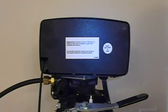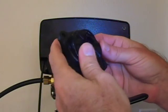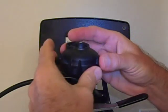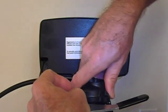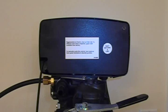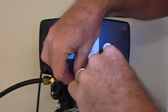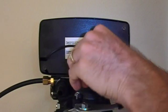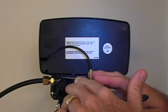Take the old one off and make sure you have the O-ring. Stick it around the bottom of this and put a little silicone lube on it if you have it. Just set it back in place — you'll hear a little pop. Put your four screws in and screw them down tight. Press your cable back, and then you can restore the water once you have everything back in place.